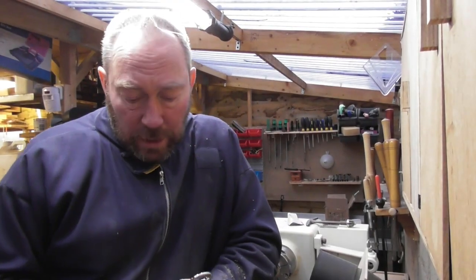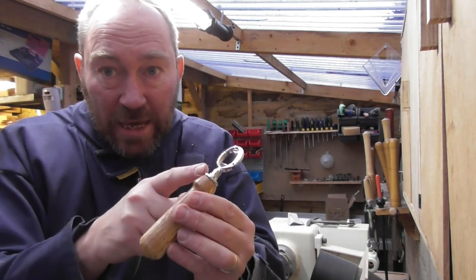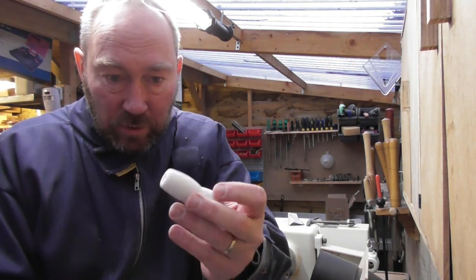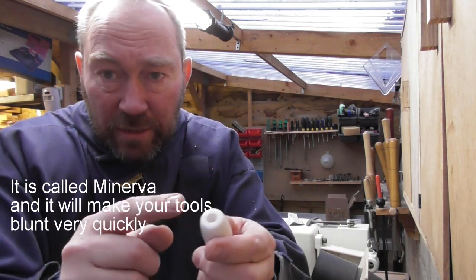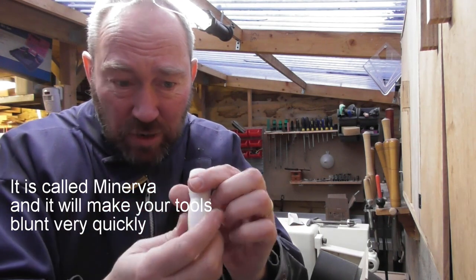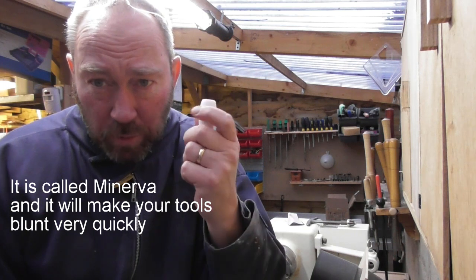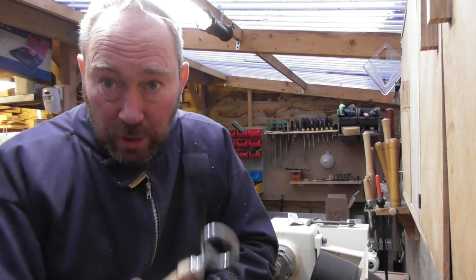I hope that's been useful. Here again we have the finished project kit. For this bit of wood, an 8mm hole for the kit part. If you're using a different medium — I've got a bit of kitchen worktop here, I think it might be Corian — this took an 8.5mm hole because the thread won't cut into it as it's really, really hard. So: 8.5mm hole in something like Corian, worktop, or acrylic — any hard material like that — and 8mm hole in wood.